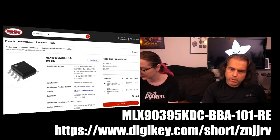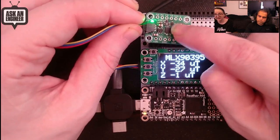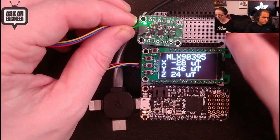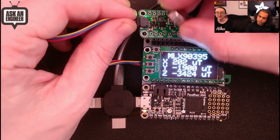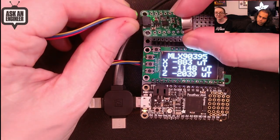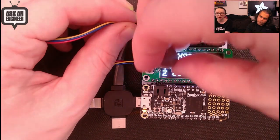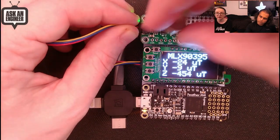Here is the MLX-9395 — on a PCB designed for the 9393, with the 9395 soldered on. I have a large rare earth magnet here. You can see as I get close, it doesn't saturate — it can handle quite a powerful magnetic field; two of these together can really pinch your finger. As I twist it, you can see how the X and Y axes change, which you'd use to detect rotation. You can also see the numbers move as I move it in X or Y, and the Z axis going in and out.